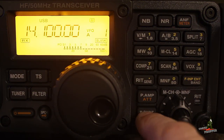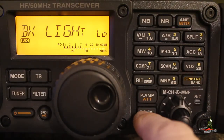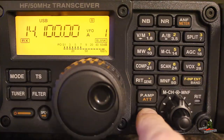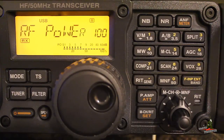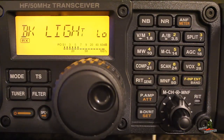I'm going to skip ahead and come into the main menu and turn the backlight down so it shows up okay on the camera. The ICOM radio has two menus: the quick set mode and the set mode. We're going to go into the set mode, which has most of the features for the radio. The quick set mode sits above that and is the quick access menu for things you need when operating the radio. To get into the set mode, press and hold the set button once — this is the quick set mode — then hit it again to go down to the lower level.